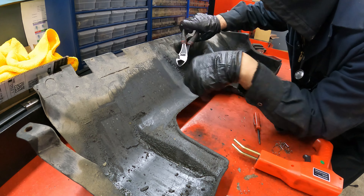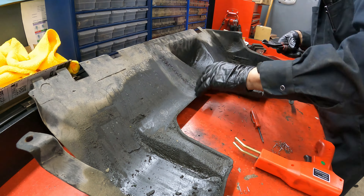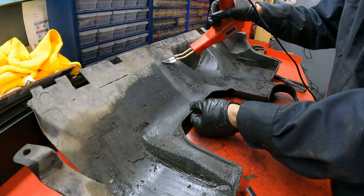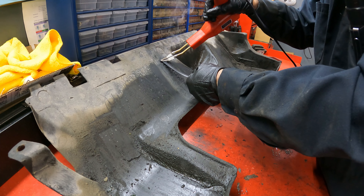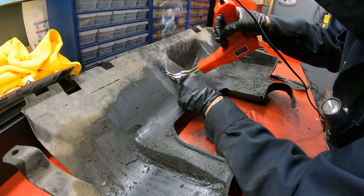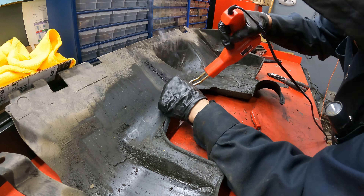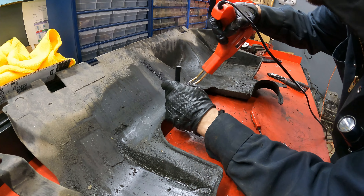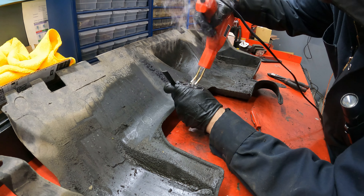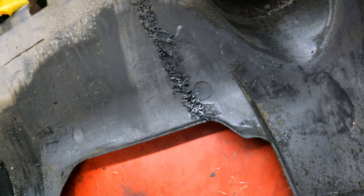You clip off the ends of the little metal pieces so that it sits kind of flush. The last step is to use this like a soldering iron and melt a piece of plastic over it to kind of smooth it out — it's like TIG welding, but for plastic. It might look like Frankenstein's neck, but it'll hold and it'll do the job.